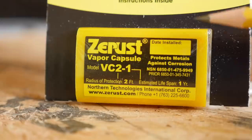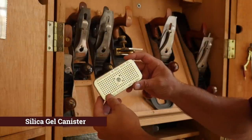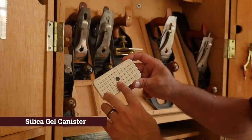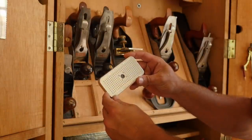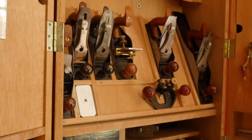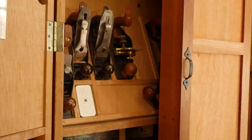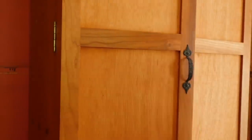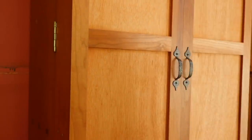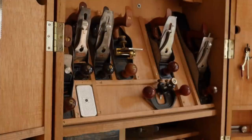Just mark the date installed in the space provided and you'll know when you need to replace it. This silica gel canister prevents tools from rusting by removing moisture from the air inside toolboxes and drawers. The desiccant is neatly sealed inside a steel container. Each unit protects up to three cubic feet of enclosed space and can be used over and over again. When the indicator window turns pink, the hydrosorbent material is saturated. Reactivate the device by placing it in a 300-degree oven until the indicator turns blue, or about three hours. The inert material will not stain clothing, tools, or finishes and can be reused indefinitely.